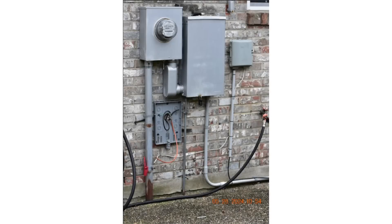Looking at your panel, there's a piece of tubing that comes down and goes slightly to the right — that may be your ground. There's also, just to the left of that, something that goes straight down — that may be the ground too. That's what you want to bond to. It'll be a copper, probably number six, smooth, bare wire. If you talk to an electrician, they'll know what bonding is and can help you.